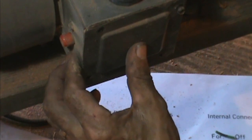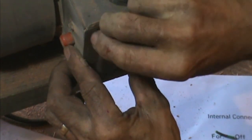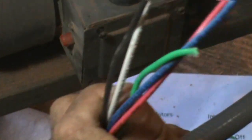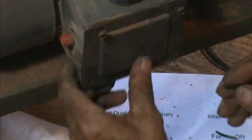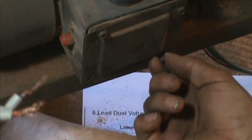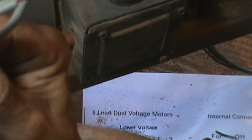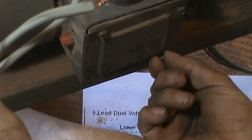I know all my connections are good, they're all secure, they are protected — no bare wires showing anywhere. I have all the wires coming up out of the other end of the pipe and that will go into the new switch box. Two wires — the ones that were originally hooked up inside the motor powering it up — will go to the opposite side, and this is my line one, line two, plus the ground in there, and that's what's going to feed the power.